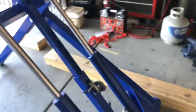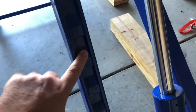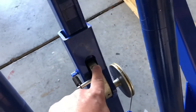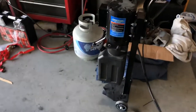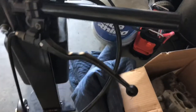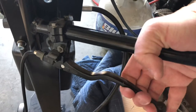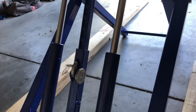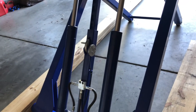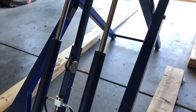As far as safety, this does lock in. There are locks, and as the lift is going up, the safety mechanism is locking it in place. On the control side, there's a little clutch lever — as you pull the lever, it allows that safety to release. So to lower this down, you have to pull that clutch lever.